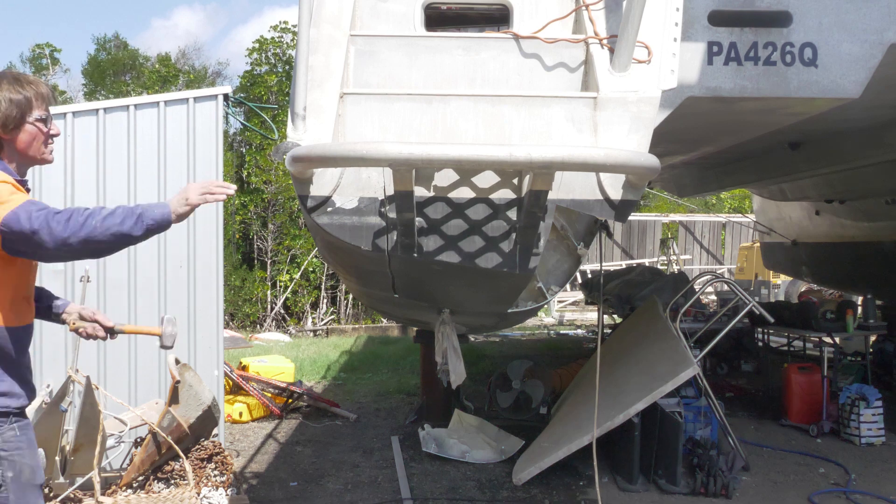We're going to wait until the boat's floating before we do the final tune, because — spoiler alert — we're extending the boat. We're changing a fair bit at the back end, and it's going to make our trim different, which means where the mast is in relation to vessel trim will change. We want to go up about 8cm or 80mm in the stern compared to the bow, so hopefully with this extension that's going to happen, fingers crossed — a fair bit of guesswork on that one.